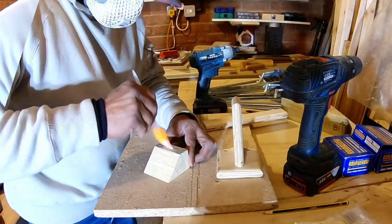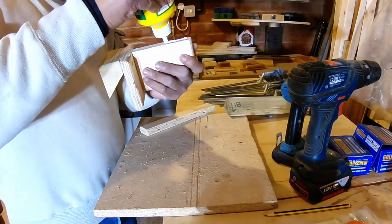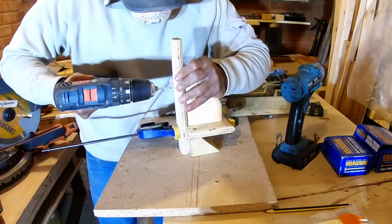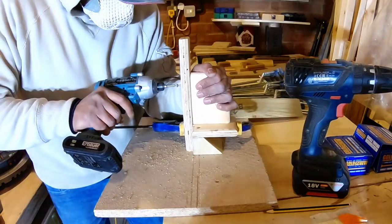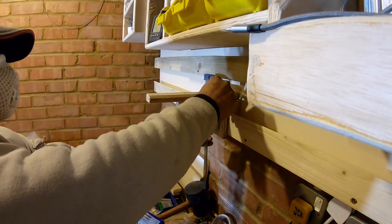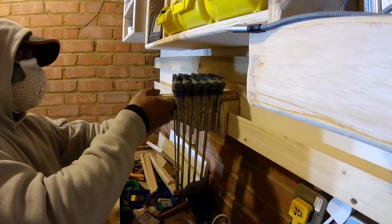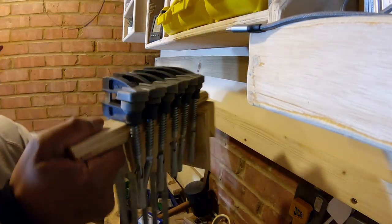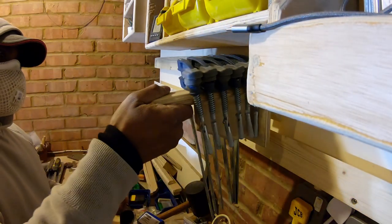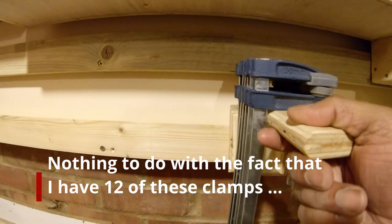It's got three parts to it: the front part, the backing plate, and the top long strip on which you actually put your F-clamps on. The long strips are designed so that you can carry the entire cleat assembly to your workpiece, do your project, and then put it back on the cleats again. I liked the design so much that I made two of them.